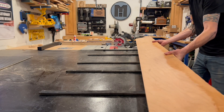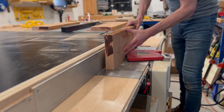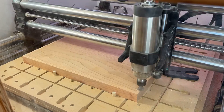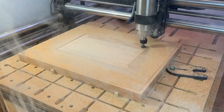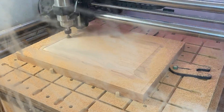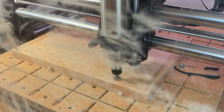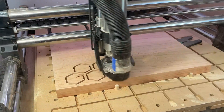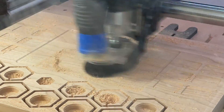That ended up being problematic later — I'll get into that in a minute. With a working prototype and finalized design, I got to work on fabrication. I milled up some 8-quarter cherry, flattened it, and glued it up. I started with 8 quarters so I'd have plenty of material to flatten on the CNC without losing too much thickness. When you have inlays that need to sit at a very specific depth, flattening to the Z-axis is super important. I secured my piece to the wasteboard and ran a simple flattening toolpath, making sure to use stops so whenever I had to take it off the machine, I could put it back in the exact same position. Then I started cutting out all the cavities for my copper parts, lighting, iPad, and logo.